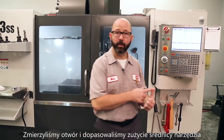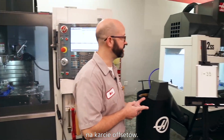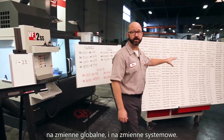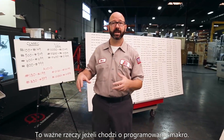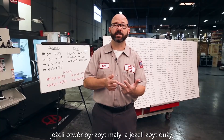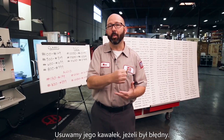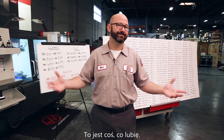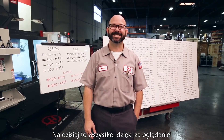We accomplished what we set out to do — we probed a bore and adjusted that tool diameter wear offset. More importantly, we looked at local variables, global variables, and system variables. This is the important stuff when it comes to macros. Now you know exactly which variables you can use and which ones to avoid. Follow the link in the description for the program we used. We'll also link to a longer, more advanced program that probes the bore, reruns the part if it was undersized, and mills away the part if it was oversized — so a bad part can't even leave your machine. That's it for today, thanks for watching this Haas Tip of the Day.